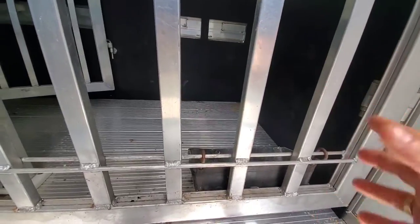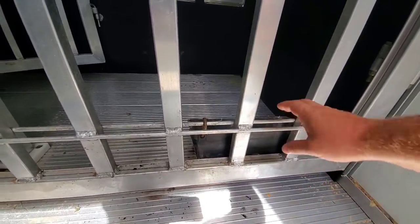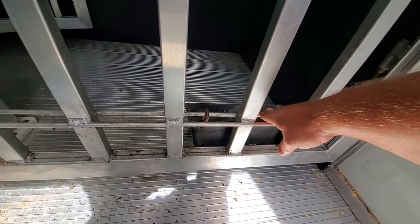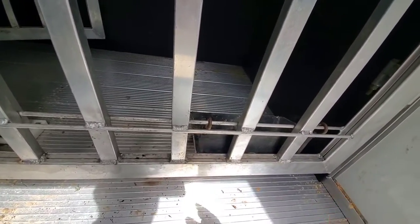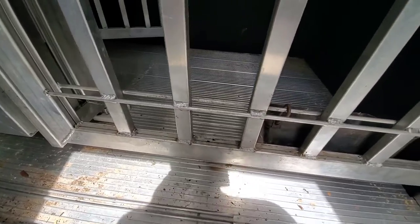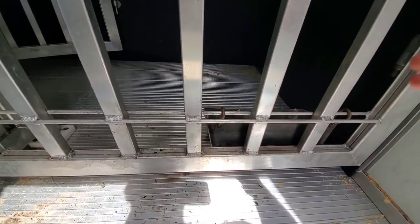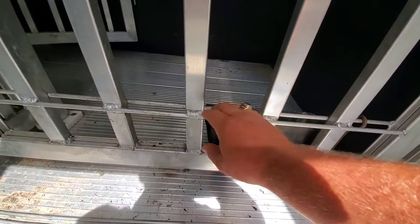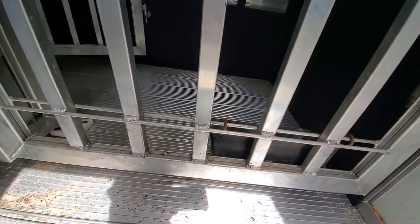But it's one of those things that I don't think they really thought about when they build these trailers. This is your standard hog feeder hung on this round bar here. That's fine when the hogs are little, but as they get bigger you need to raise these up because they're down so low it's harder for the hogs to eat, and the shavings get on them if they ruffle around with their feet. So we got some round rod here and we're going to get those cut to length and weld them on — going five inches above this existing rod. That will make it much more practical. And as the hogs get bigger they like to take these things and flip them up. Well, they have chains on the bottom, so when we move this mounting point up higher, that chain can hook on here to keep them from flipping them out.